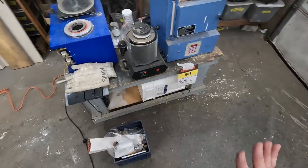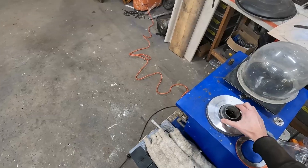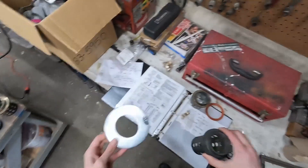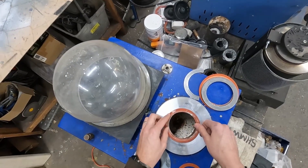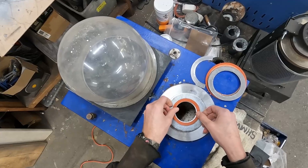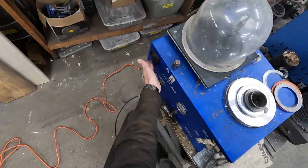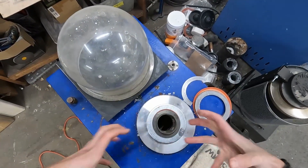That's going to take a while to heat up. For the vacuum casting setup, we turn this to chamber. This ring isn't the right size, so we have an adapter ring that is. We take one of these rings, put it in between with the adapter ring, get it centered, and it fits right down here. Then we turn the vacuum on, which pulls vacuum down sucking the metal into our mold.